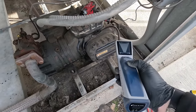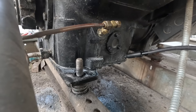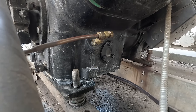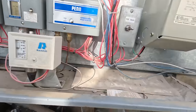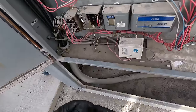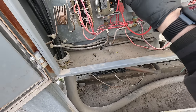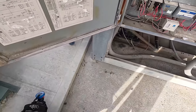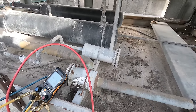Do we have gasket seals leaking around the top here? What exactly is our major malfunction? I did try to clean some of this crap off, but it's counterproductive when you've got that much grease. Pressures are really low, so let's go ahead and get this thing warm and running. There's a low pressure switch here set to cut out at about five pounds - unfortunately it was very reactive and cutting in and out. We're going to be adding refrigerant the whole time, so I'm going to go ahead and bypass that so I don't short cycle the compressor.